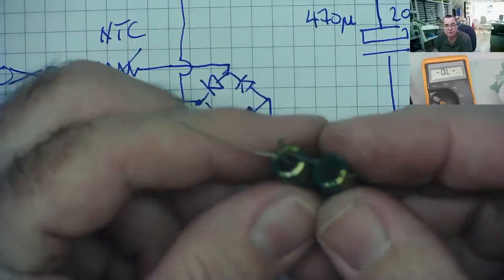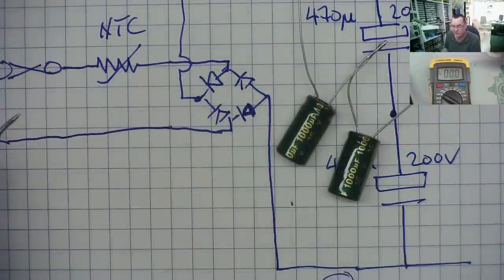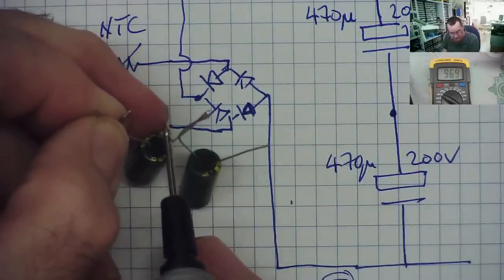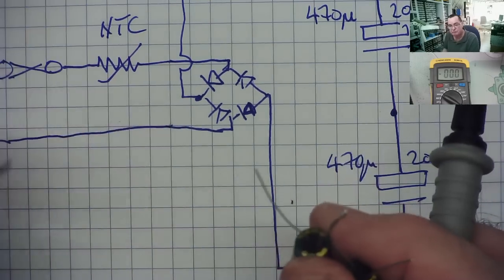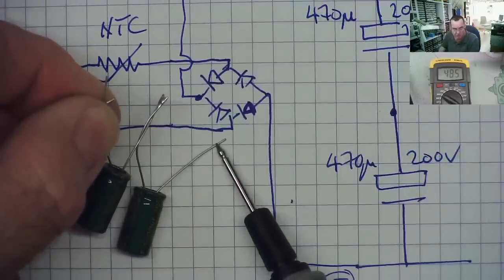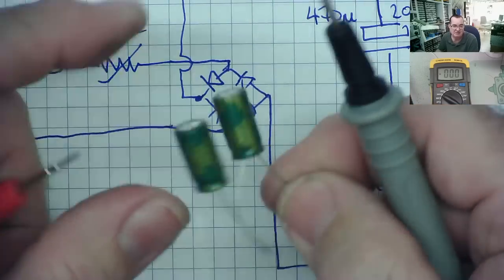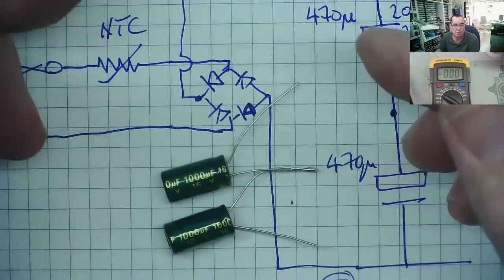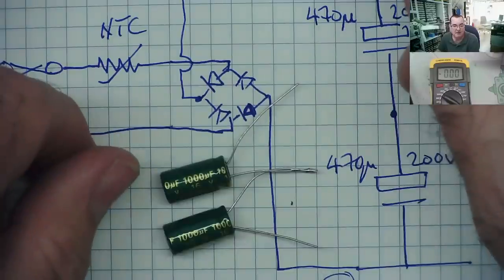We have our two capacitors in series - let's measure what we've got using the capacitance meter on the 2000 microfarad range. The first one reads almost 1000 microfarads. The second reads almost 1000 microfarads. Now let's read across both of them like we did with the resistors - do we get 2000? No, we get about 500 microfarads. So when we wire two capacitors in series we don't get the sum - we get half, if they're both the same value. Two 1k resistors in series gave 2k. Two 1000 microfarad capacitors in series gave 500 microfarads.